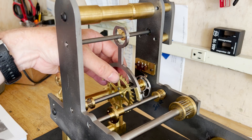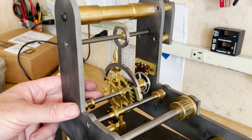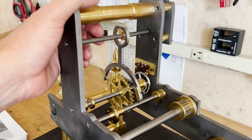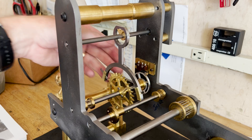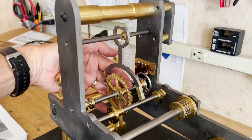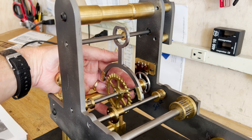With just two small magnets it has plenty of force to give the power it needs to keep this clock running well. I've got to harden these pallets — I'm waiting for a number one modulus cutter for my wheels, and it looks like it's not going to come in time, so I'll probably have to figure out how to make one. All the wheels use the same modulus. You can also see the switch mounted on the back — when the wheel turns once every minute, it'll signal that switch to turn on and off.